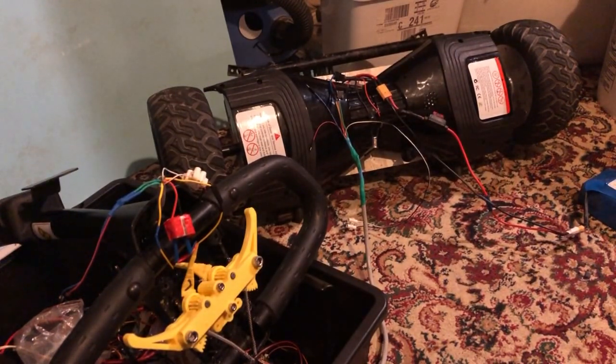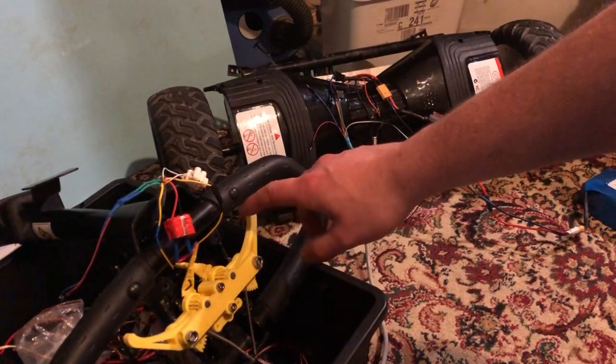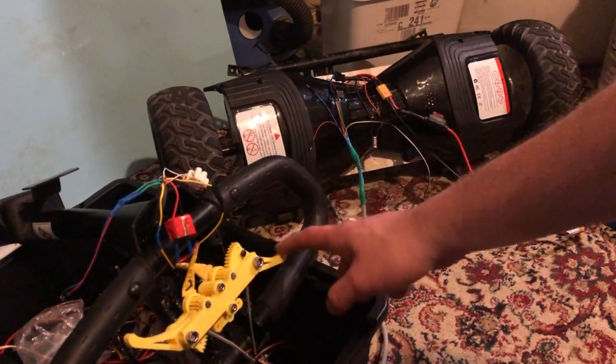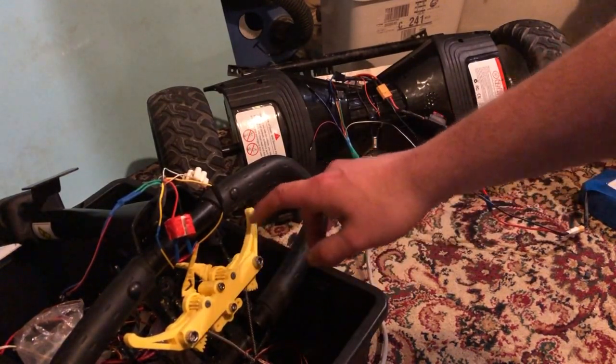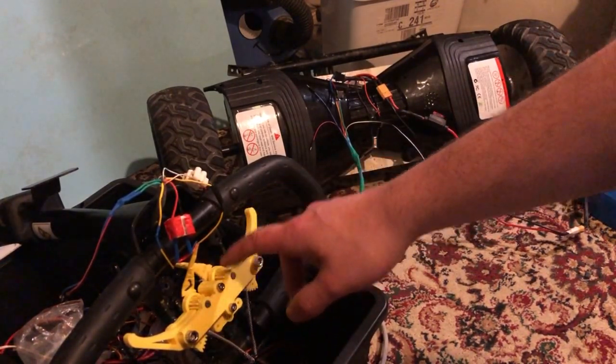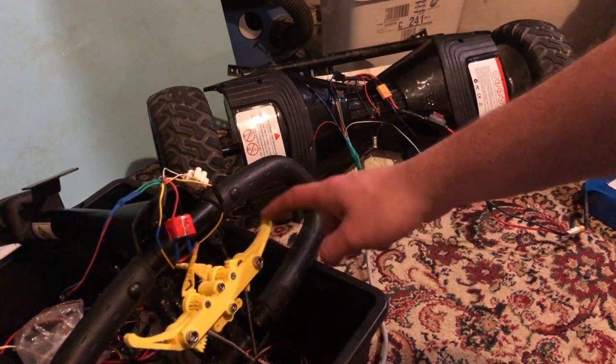So we tried using DACs, that didn't work. The only thing with that being able to do is gear up the levers so that one, I think it probably is, it's about 40 degrees there, maybe 35. So we got a 4-to-1 ratio, turning the whole potentiometer in one go. So there to there is a complete rotation of the potentiometer.